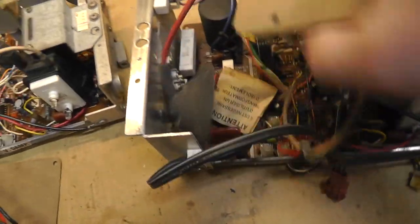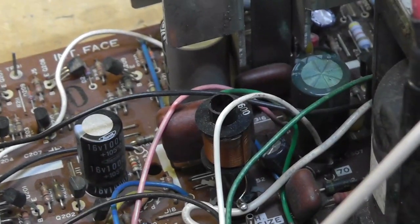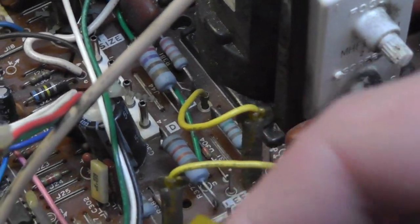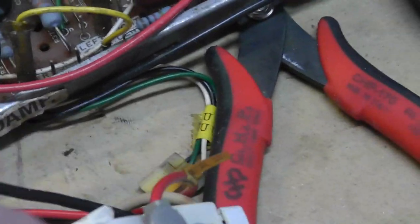All right, let's see here. Yeah, that has a 0.33 cap as well. If you can see it. There, okay, that's the cap, and this also has the horizontal positioning thing. So this one also seems to be a 4901 chassis. It has a vertical dampening pot, and it is of type 037. And what kind of neck board does it have? A -17 neck board. So a -17 neck board goes with a 37. It might go with other ones, but I'm not sure.